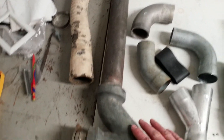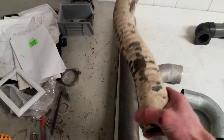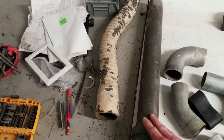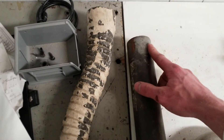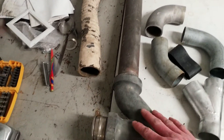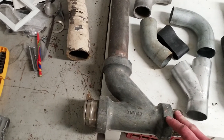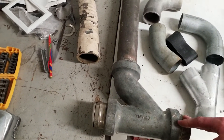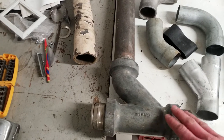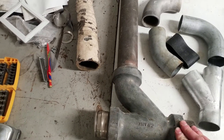On this example, this was screwed into the separator on the Spencer machine, and then they had this flexible section — not so much anymore — between the pipe, which has no threads cut on the end, and the pipe going out to the inlets, just to give a little flexibility. These are solid as hell and had to be supported with big heavy hangers and riser clamps because of the weight. This is part of what made those early 1910s and '20s systems so expensive and found only in mansions.